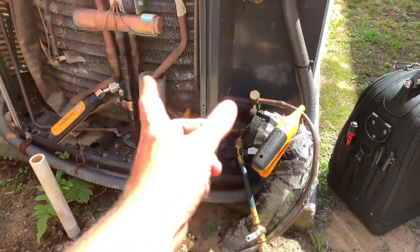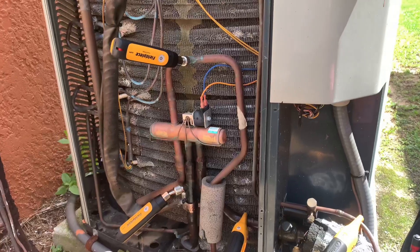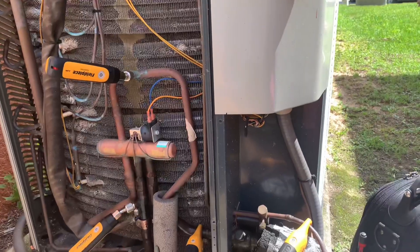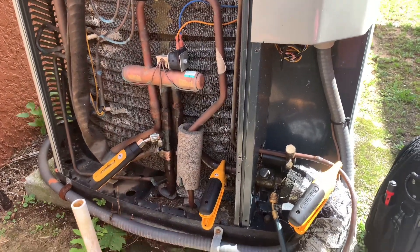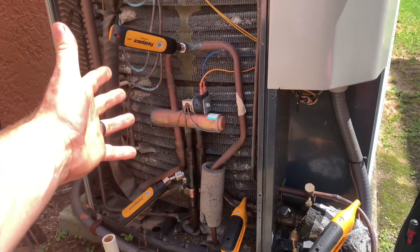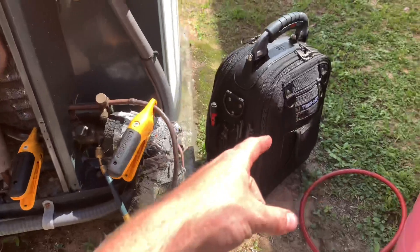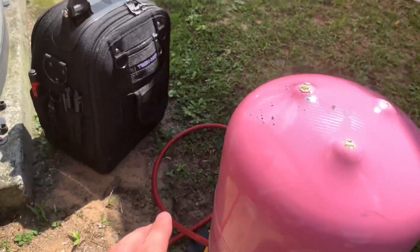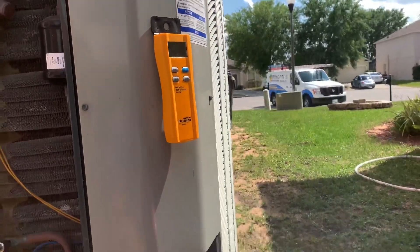Check your points there. I never use a manifold anymore — I just don't see the purpose in it, especially since we've got three devices typically, phones and iPads and stuff like that. So I just hook up my probes on this side, keep the ball valve and the stubby in my bag, and I always have a hose attached to my 410a — pop out the scale, get it going.